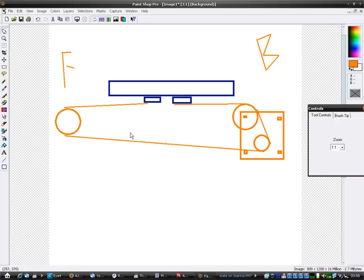And this is what's been causing a lot of problems when I print big stuff. It's the big stuff that is a problem, because that's when these little errors start to show up, and I couldn't figure out what was wrong at first. I looked underneath at the belt arrangement, and I thought, well, that's obviously the problem, because the belt is shaped basically like a triangle instead of being in parallel. It's not directly parallel.